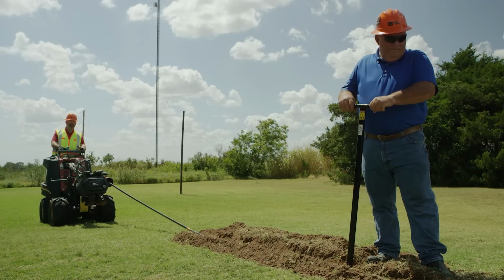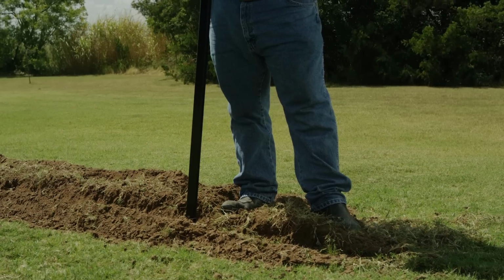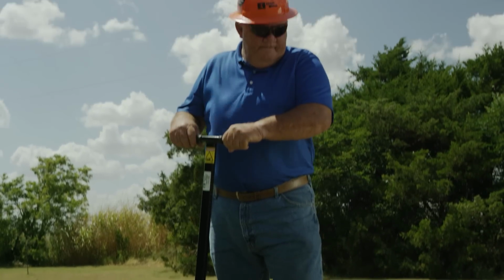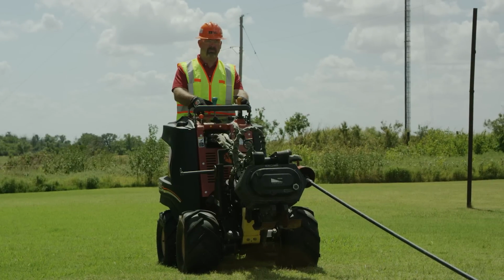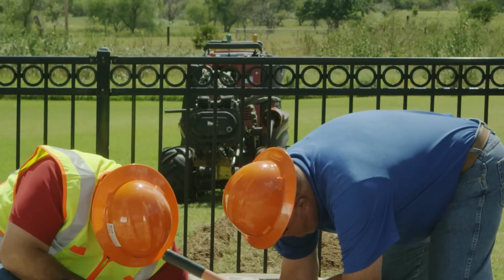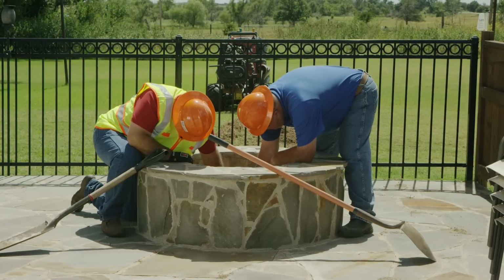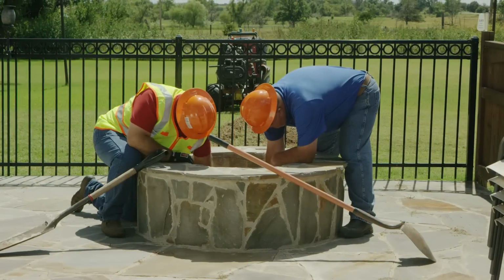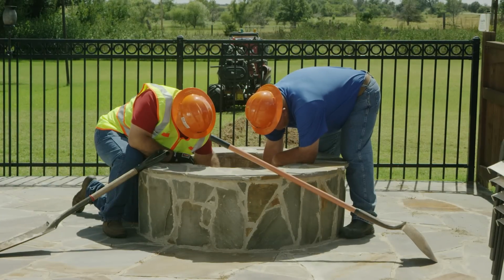Always use an approved Ditch Witch drill string guide to help align the drill string as it enters the soil, and only stand on the left side of the approach trench. The unit needs to be turned off and no one at the controls while replacing the drill bit with a back reamer at the exit pit. Never use the drill string guide during back reaming or pullback.